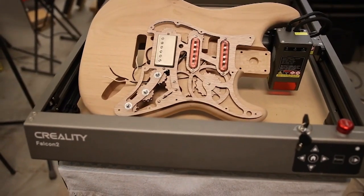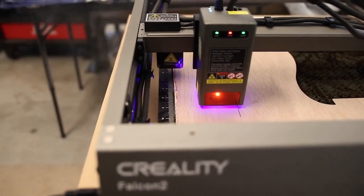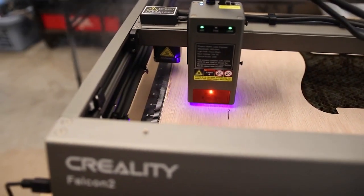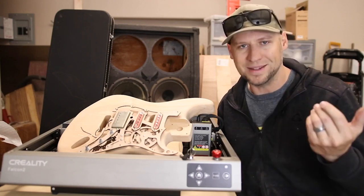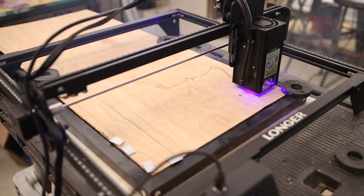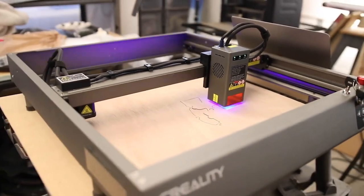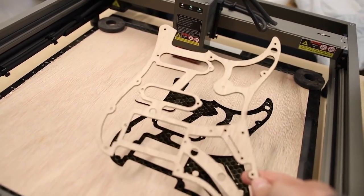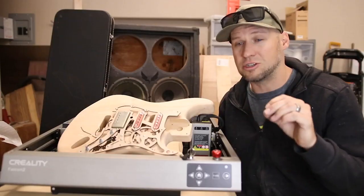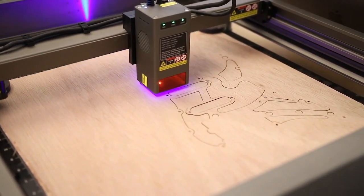There's a lot to love about the Creality Falcon 2, so I'm going to go over all the features. Most importantly, the laser module is 22 watts, making it the most powerful laser I've used on my channel to date - by 2 watts. I tried the xTool and the Longer Ray5 20W, both of which I loved, but that extra 2 watts actually makes a difference - with those other lasers I'd sometimes have to clean up edges, and I never had to with this one. It's also worth mentioning that the Falcon 2 is made for cutting thick lumber - it can cut up to 15mm in one pass.